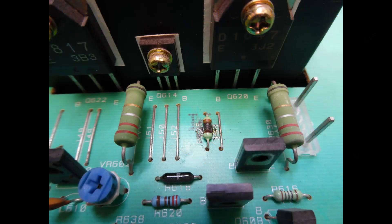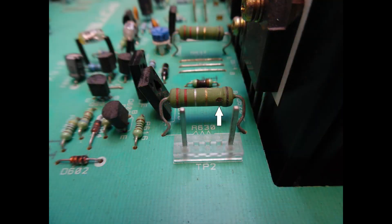Because the right channel was the failure, I'm now showing you the circuit. The first thing you can see is a burnt-out resistor on the circuit board — this is on one of the power transistors, for the base. Next, you can see a hole in this resistor — this is one of the emitter resistors, and if you measured it with your multimeter it would read open circuit, as it did in this case. The key point about these failures is that sometimes the resistor is physically burnt with scorch marks, but for this larger power resistor at 0.22 ohms, you only see a small hole — sometimes not even that. If you just replace the output transistors without further checks, they'll fail again because of faulty emitter resistors.